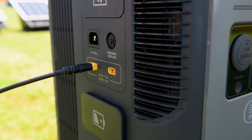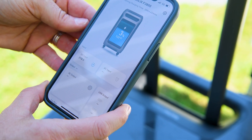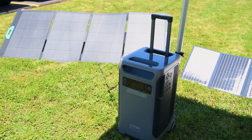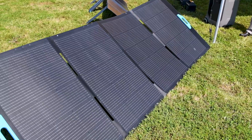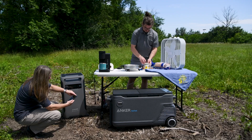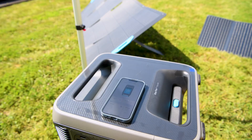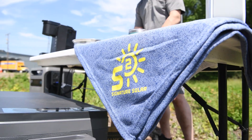If you can allow your setup to receive maximum solar input of 2,400 watts, this could efficiently charge the power station with max input in approximately two hours. Charging with solar is actually the fastest way to charge the F3800, since you can only charge at 1,800 watts from the grid with AC. Whether using Anker Solix flexible panels or any others with an MC4 to XT60 adapter, the system is designed for flexibility as long as the setup remains under 60 volts, broadening its appeal and making it an excellent choice for off-grid adventures or emergency preparedness.